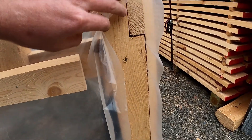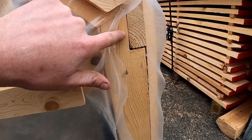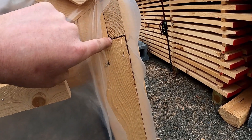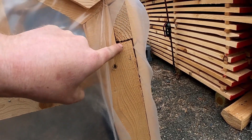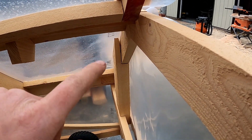It takes a ton of time notching this out. I basically used the table saw to cut vertically, and then the circular saw to cut the other direction — table saw this way, circular saw this way — and just notch the 2x4 out.